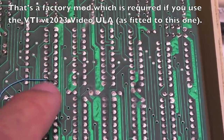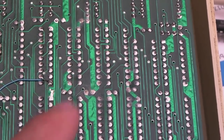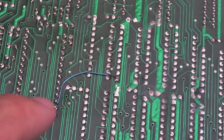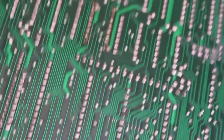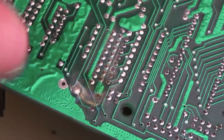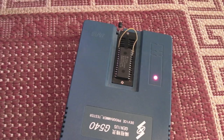There's a little wire here that's awfully exposed. I'll re-solder it and cut a little bit off the length. The same is true here — it's overhanging a fair bit. I'll clean up these solder joints. That chip has been swapped out, probably a long time ago. Some more corrosion visible, though I don't think it'll be relevant. Check for bent pins and shorts. Make sure you're wearing an ESD wrist strap.